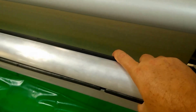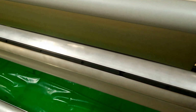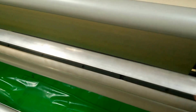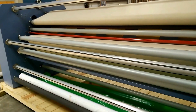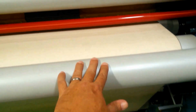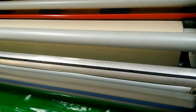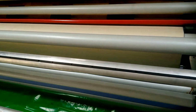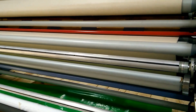Secondly, we like the bar from the standpoint of this completely fills up the core, the cardboard core inside the print paper. And when it comes to unwind tension, at least on the print paper, that's usually a high level of tension feeding into the machine. In this case, up over this idler bar and into the machine starting here. And the fact that we've got a full 3-inch bar that fills up the core keeps the core from deflecting and causing more wrinkles in the unwinding print paper.